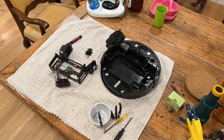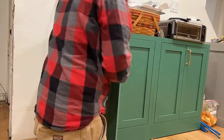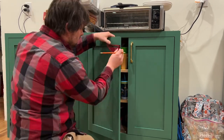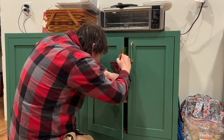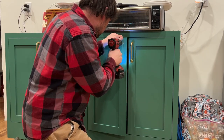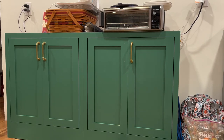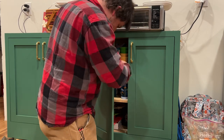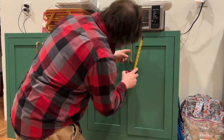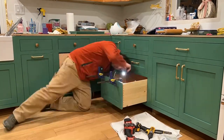Next on the list was something I had put off for way too long: installing the rest of the hardware and drawer faces on the kitchen cabinetry. Mark out by hand with a pencil, and once you're confident with your locations it's easy to drill through. I'd definitely recommend using a brad point drill bit so it doesn't walk on you. These holes don't need to be super exact — you can ream them out a little and still have the hardware cover it.